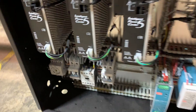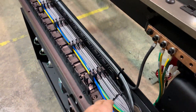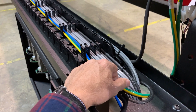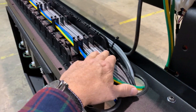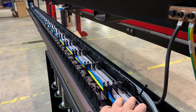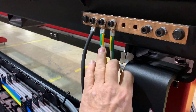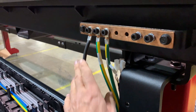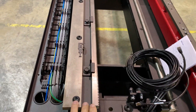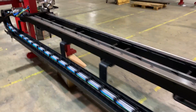Pretty high quality. Our machines use wire by a company called igus, and also their cable carriers — ultra high quality stuff. It's very good at electrical resistance in a noisy environment, and we're talking electrical noise, for instance from plasma cutting or high-def cutting. We also use extremely heavy ground cables; they're everywhere all over the machine. It's the only way to ensure that you have a good ground. This is the gear rack system right here — you can see it a little better with the rails. Three-quarter inch gears — we didn't do anything light duty on this machine.